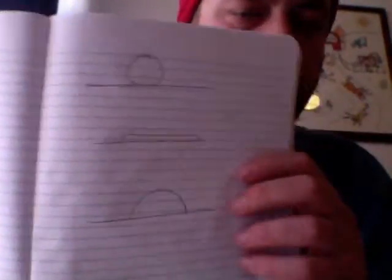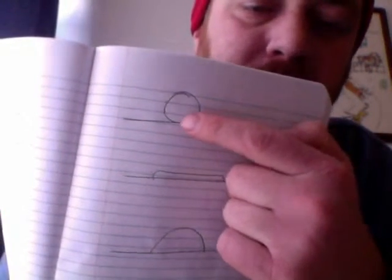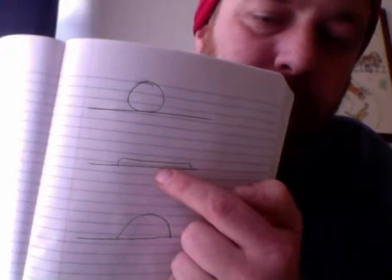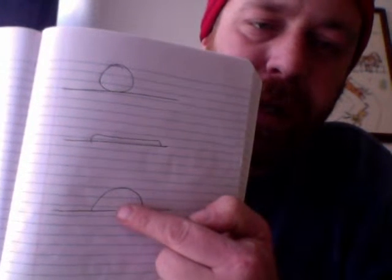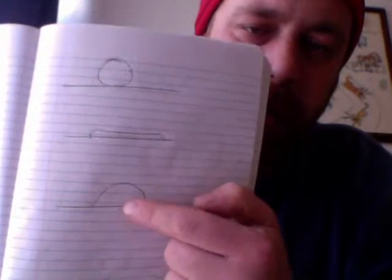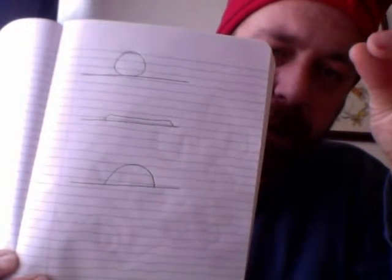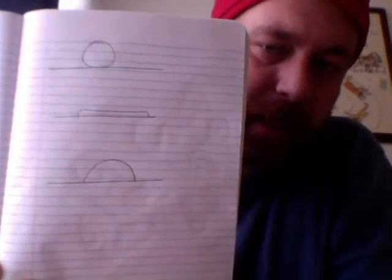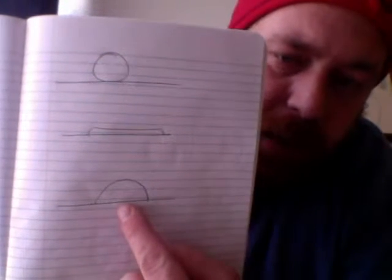Okay, so if this is your bed here, right, and that's flat, your first layer lines should not be sitting on top of it like this, nor should they be smushed perfectly flat like this. You want something like a semicircle. And you can actually just start printing a square or something and then manually click the steppers over by turning the vertical Z-axis screws until you see with your eye, like really close in a bright light. I like to use a headlamp sometimes when I'm working on printers, until you're getting this cross section, and that should give you really good bed adhesion.